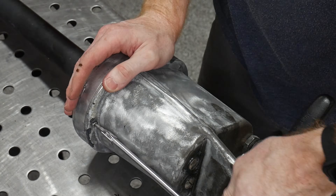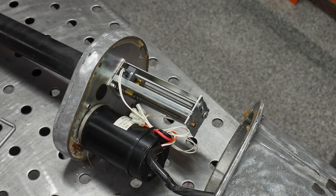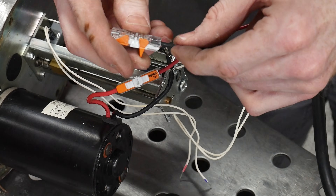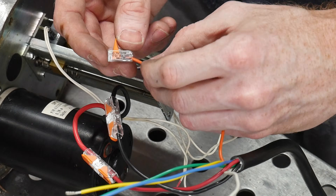The first thing I thought could have been wrong with the system was the wiring coming into the motor housing. The shield on the cable had been busted and I saw exposed wires, so I cut back the cable and re-established the connections. The cut-back cable will be cleanly protected in the plastic cable gland upon reassembly.